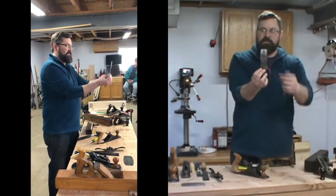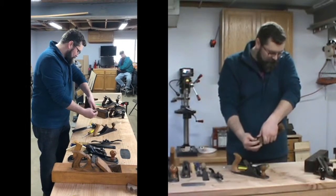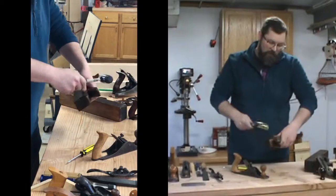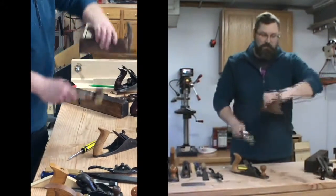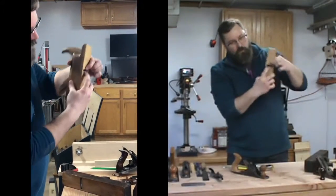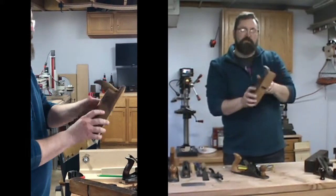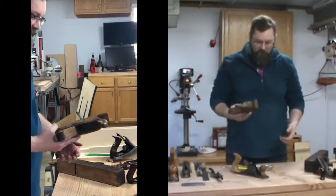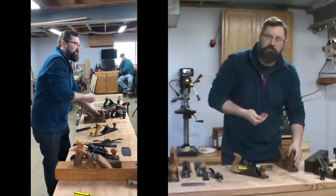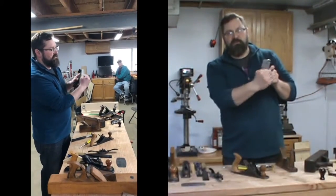The iron has a nice curve. About a quarter inch of space between the iron and the throat — the opening is the mouth — so that's wide open so that you can take a big cut. These planes are used when you want to remove a lot of material quickly, but they leave a scalloped surface. If you're cutting across a board, you're going to have scallops that will then have to be taken out, but it's the fastest way to remove material.